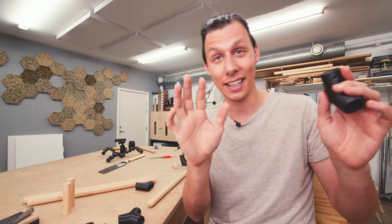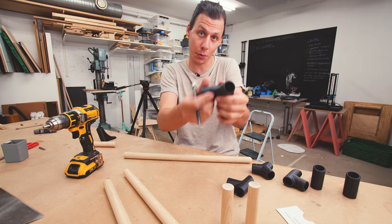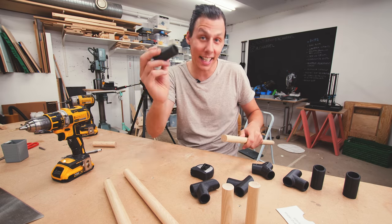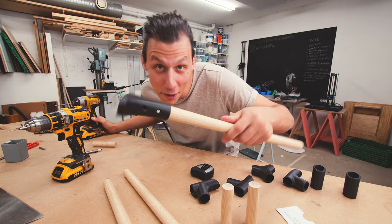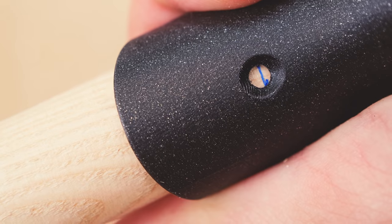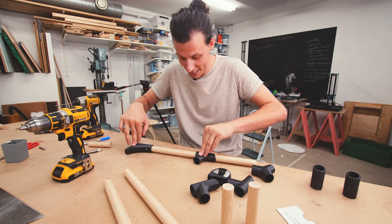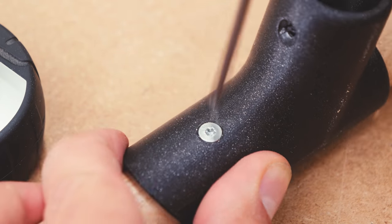Let's put these together. Since I modeled these parts in 3D, I know exactly where the hole locations for all the screw holes need to be, so I'm just going to mark those right now. Now I'm going to drill the top hole, then take the top piece and slide it in place and screw in the screw. Before drilling the second hole, I'll take the bottom part and slide it in place, aligning the hole with the mark I made. To ensure both pieces end up in the same plane, I'll put them on the table and push flat — they're the same exact thickness, so this ensures they end up straight. That's one of the legs complete — let's do this two more times.